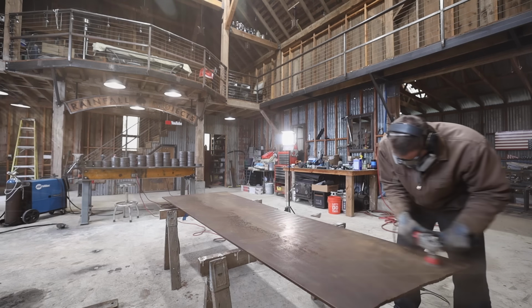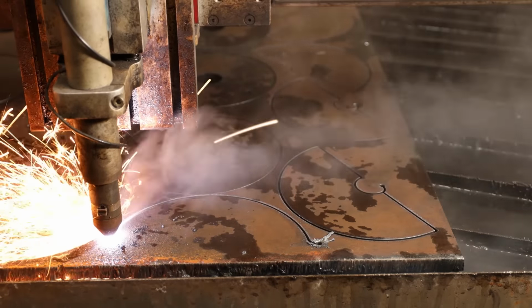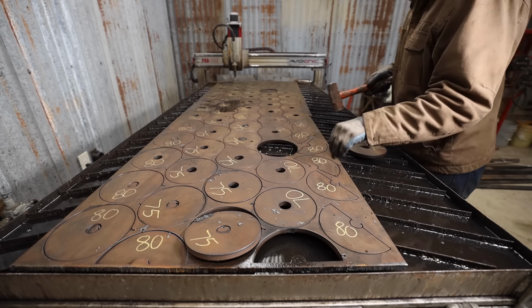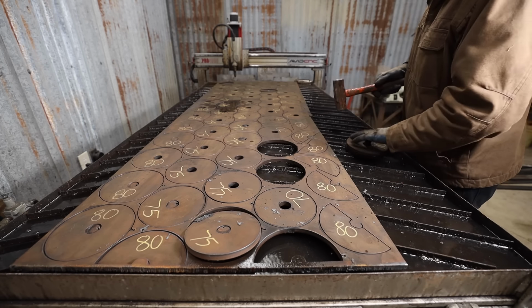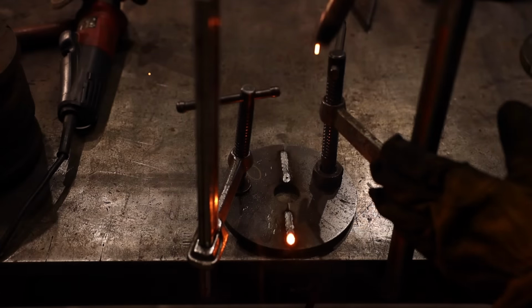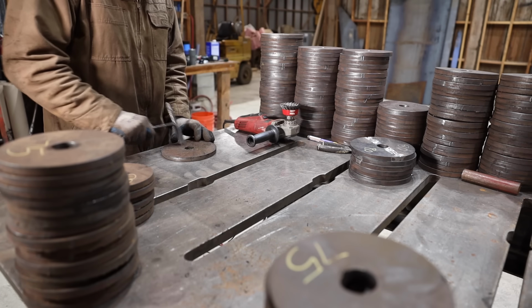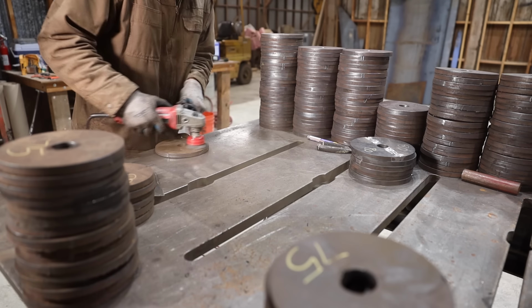I realized that if I cut some plates in half, I could fit quite a few more around the outside and really minimize the waste. I just welded them back together and plan on putting them on the inside of the stack of plates on each dumbbell. I chipped off the slag on each plate and hit both sides with the wire brush on the grinder again.